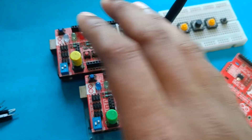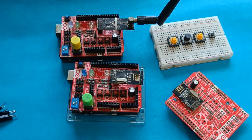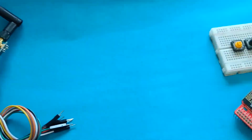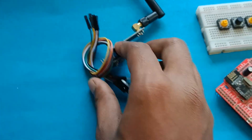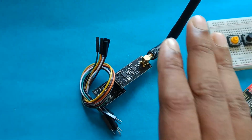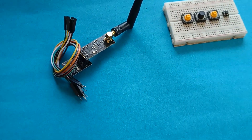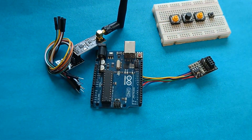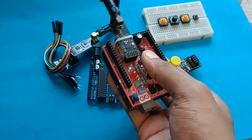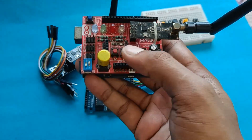It's a perfect fit and you don't have to worry about the NRF module connections with Arduino or about proper power supply. There is a large capacitor on the input side of the NRF module shield, and on the bottom is the AMS1117 3.3V regulator to give constant 3.3V supply to the NRF module. You have onboard LEDs and onboard buttons — no need for external buttons on a breadboard. I made this for my final year project and it became very handy. For most of you who don't have this shield, I will show you how to connect using jumper cables with a normal Arduino.